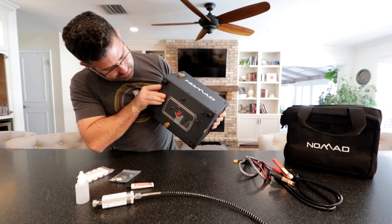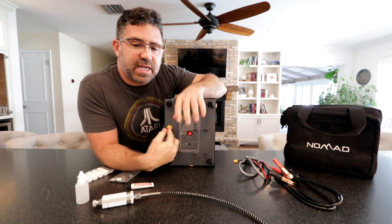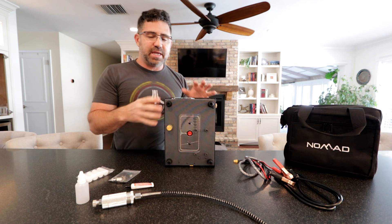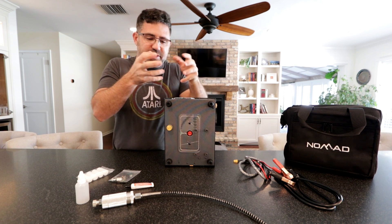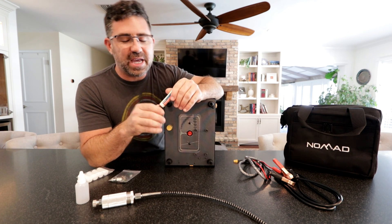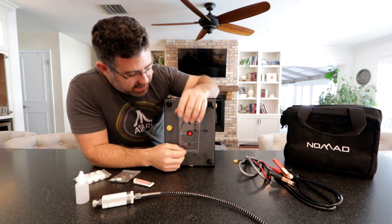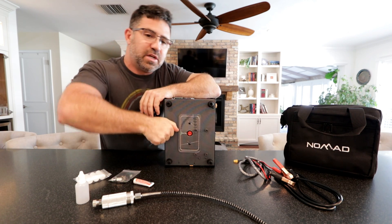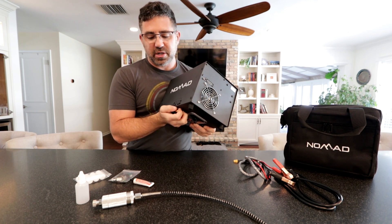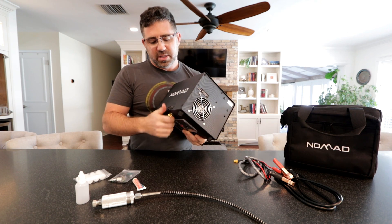On the bottom of the unit there's some pretty cool stuff too. This here is kind of like a master drain for the unit — it has some sort of internal water/moisture separation, likely a reservoir inside. When you're filling and condensation builds up, that water pools in the reservoir along with the silicone oil drops you've been adding. The owner's manual says to leave this closed, but every 20 or so fills, open it up with a rag or paper towel underneath — when you open it under pressure, it purges out all that moisture and oil that's run through the machine.